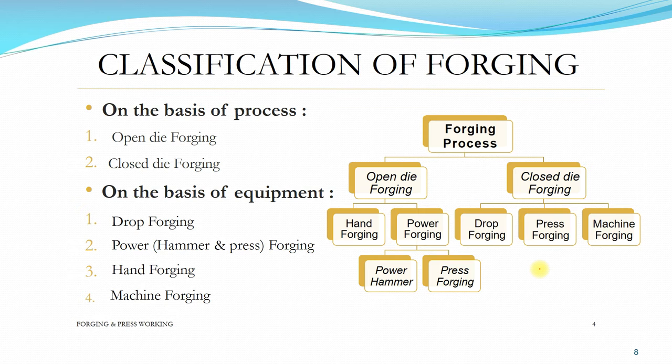It's very difficult to control the machines to have a uniform force. Normally drop forging is a continuation from the blacksmith process of hammering, and then they changed it from trip hammer to a drop hammer. It just continues the same process, but the drawback is that the force cannot be controlled uniformly or evenly, so this kind of process is normally not applied in industry.